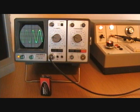We've looked at the full wave and half wave rectifiers and how we use smoothing capacitors, and finally the voltage regulator IC to give a perfect smooth 12 volts. I hope that's been useful and good luck with your studies. 73s from G0FUW.